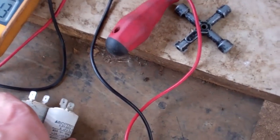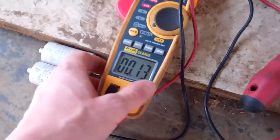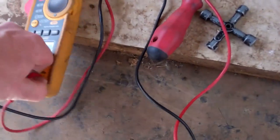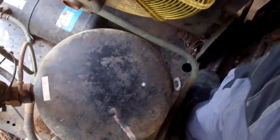I've had some power problems over the weekend which I think was the cause of the problem. With the delay timer, one compressor would have fired up first, then six minutes later tried to run the other one. I suspect this one fired up first, tripped out, and by the time the other one cut in the power situation had improved.